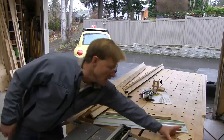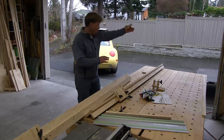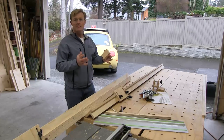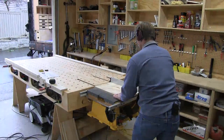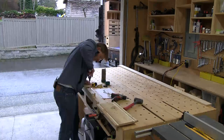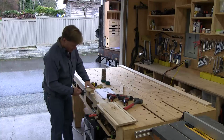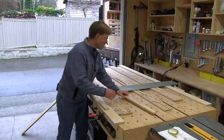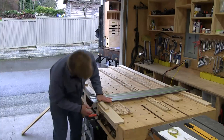The next part is to put on the stop blocks. When these are installed, you can pull them back tight to the bench and know that your reference point will be from the end — it'll make sure that it's square. I've cut these blocks to be identical, so measurements and dimensions aren't as critical as everything matching. You can use C-clamps or any kind of wood clamp that you can fit underneath. Since we want the knob to stay nice and tight and the bolt to actually move, I'll put a wrench on that and really reef it down. And there you have it — a simple little stop to set the rail height. Put some scraps of the thickness of material you're going to use on either side just for setup, then drop on the rail and adjust.